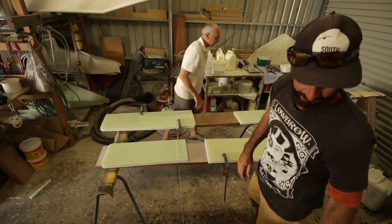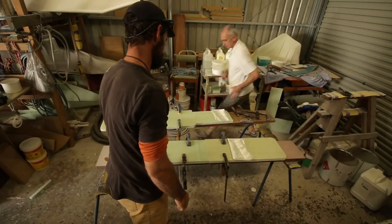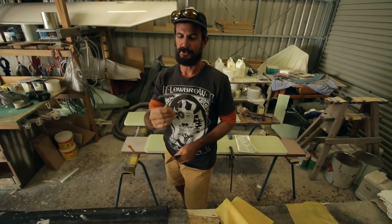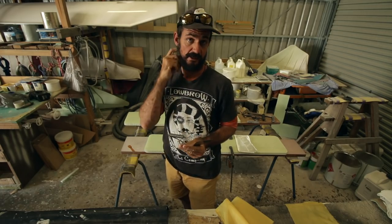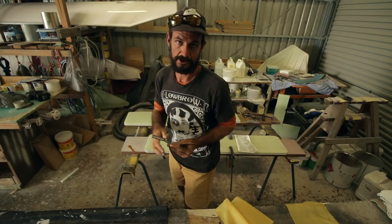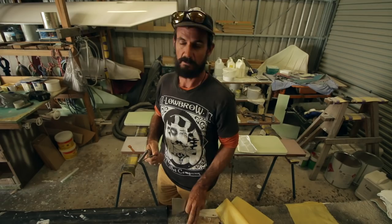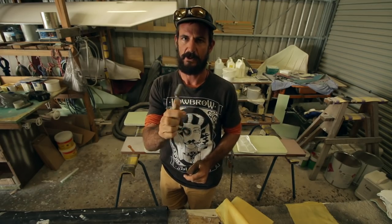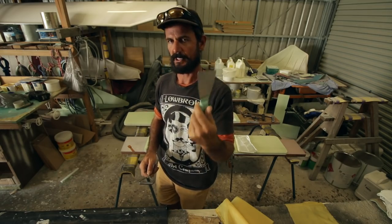Our technique for joining the seat planks was to use thickened epoxy as a glue, then make the join with two layers of double-biased fiberglass wet through with unthickened epoxy. In the past I've used brushes, and I've consigned a few rollers to the bin through not cleaning them properly. I've used vinegar to clean up epoxy before — but David's advice was a toothbrush and a bit of methylated spirits. He's built a mighty catamaran, so this toothbrush and scraper approach — not paintbrushes — we'll see how it works.